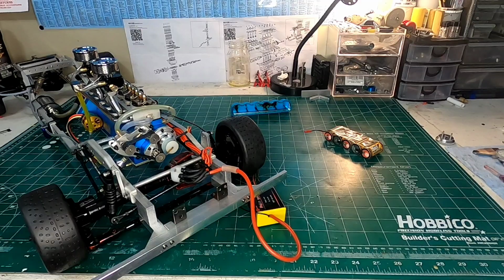Now get your cooling working, because when you do get it started, you're going to see that you're not going to have much flow for the water pump. Maybe I have a defective water pump, I'm not too sure, but I would love to see some videos of people running their engines and getting a shot of some flow from their water pump, because mine doesn't do anything. I've given up on my water pump to the point that I've bought my own external water pumps, and they are now working. The engine is now running. I've run, like I said, half a gallon today alone, about 5 hours of running, 12 tanks of gas today alone. So yeah, it makes a big difference when you can cool your engine.